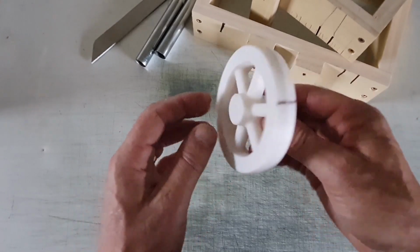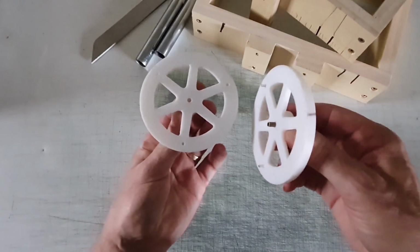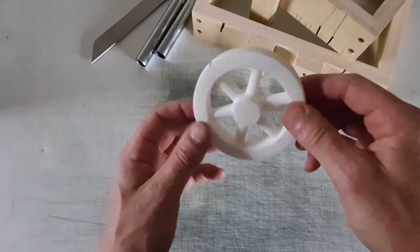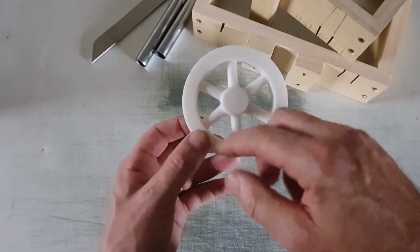So this is a 3D printed item. It's a split pattern, so we'll have one side in the cope and one side in the drag, and then we'll bring those together and then we'll cast this item. We're just going to do it in aluminium, still in a learning stage of casting.